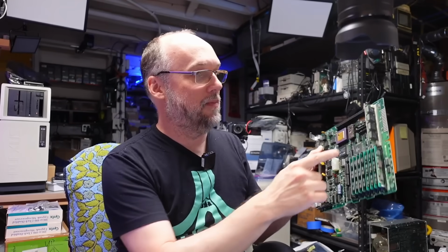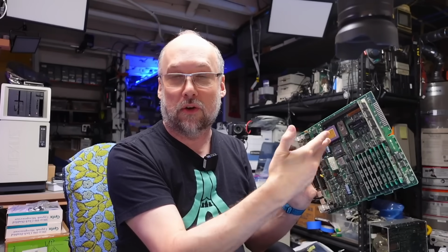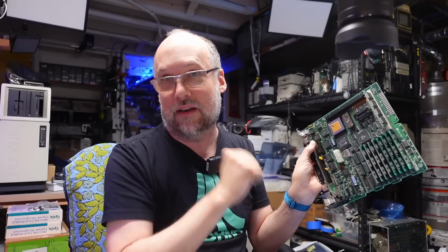If your Mac SE has these particular TI RAM chips on it, when you first apply power to the system before those RAM chips are initialized, meaning they're erased by some ROM code, then they default to this pattern of white and black horizontal bars. And then what happens is if the motherboard passes its main diagnostics that are coming out of the main system ROM, that's on the ROM SIM right here, then it will kick off the video initialization based on the video ROM chip here. Think of it like a video card that's plugged into a Macintosh or a PC for that matter, and the BIOS code or the ROM on the system is booting up the system, and once it feels it's ready, it will then kick over to the video ROM that's on the card or integrated into the motherboard in the case of the SE30, and then that goes and initializes the video.